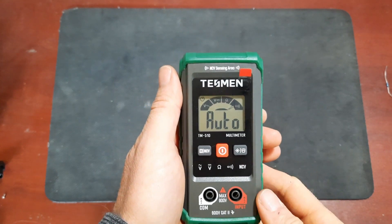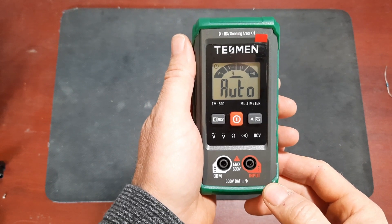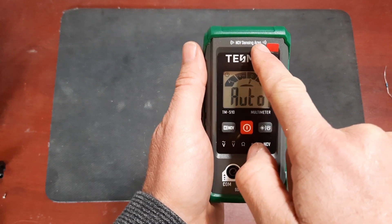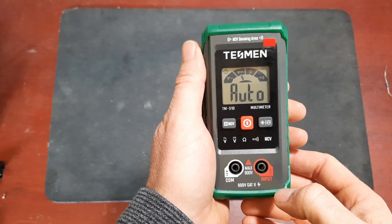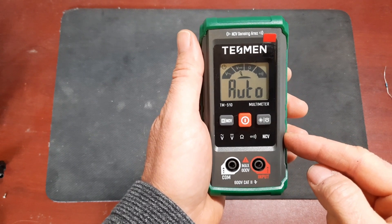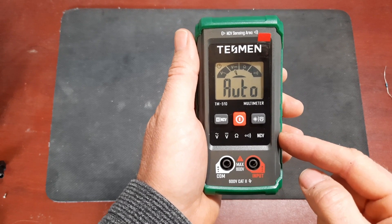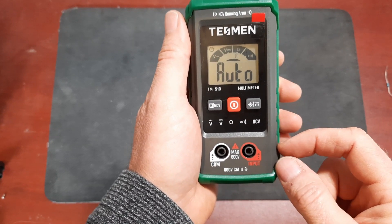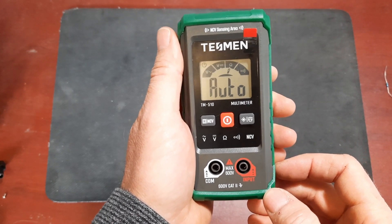To summarize: I think this is a great little meter for hobbyist work and it would be handy in a pinch for continuity and voltage testing. The non-contact detector makes it a nice safety check when working on home wiring. I definitely would not use it for high voltage work - nothing over 12 to 24 volts DC probably, and low currents. It's reasonably accurate and very inexpensive for the number of features provided. As long as you avoid high voltages, this unit provides good value for the price.